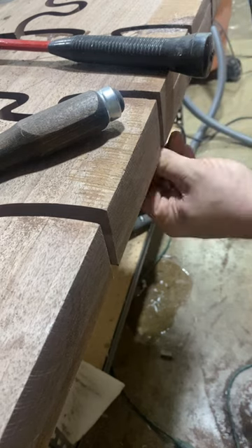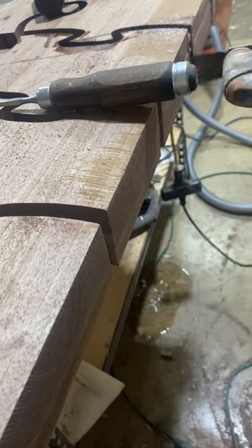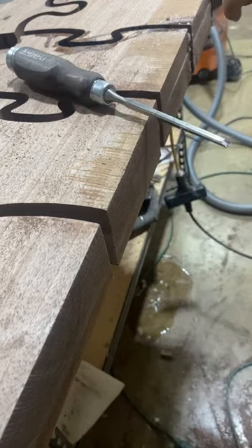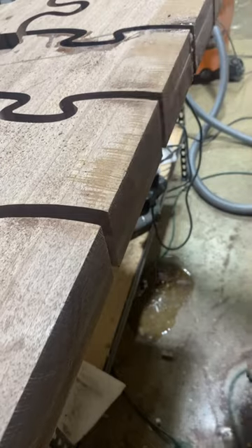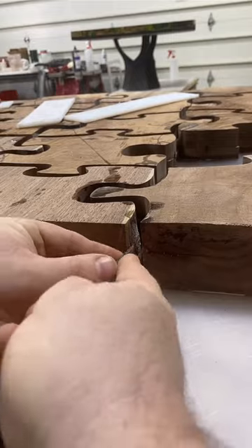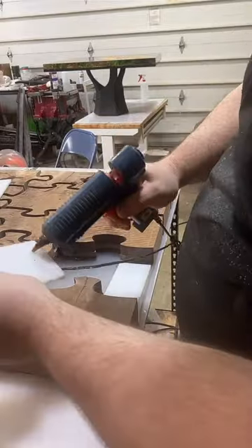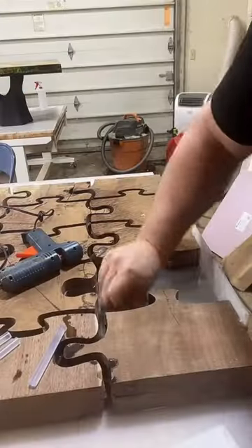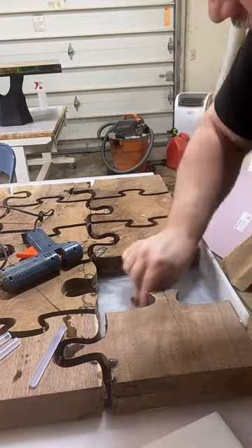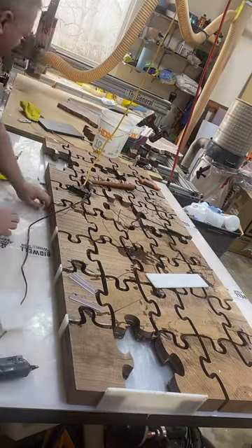After remolding we'll be able to pour and those little slots will fill up. Here's one of my first screw-ups — this didn't come out all that bad but I definitely should have made a jig so the lines would be straighter. The Dremel multi-tool left some stuff behind so we hit it with a cheap Stanley chisel — use your cheap chisels when you know you're going to be prying. Then we hot glue polyethylene strips, but right after we forget that we need to sand the inside of these missing puzzle piece cutouts. Rework always takes twice as much time.